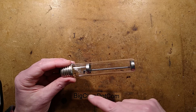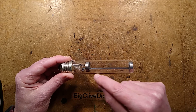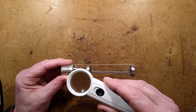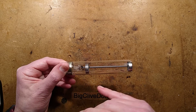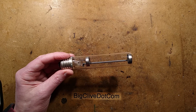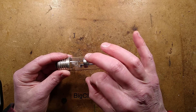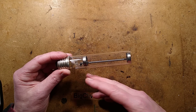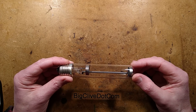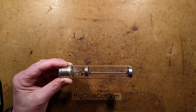That's more or less it. To summarize: ballast resistor, ignition resistor, ignition electrode, one electrode, the other electrode, neon as a carrier gas, and mercury vapor. I don't see any droplets of mercury vapor — let me just double check. I can see a slight hint of mercury vapor, a slight crystalline effect on the resistor lead but nowhere else. It's probably just enough mercury vapor needed to do the job. I was expecting it to have an amalgam in here that with heat would gradually liberate more mercury, but by the very nature of its operation it needs the mercury to be basically diffused through it anyway. That is the Philips TUV UVC lamp — and if you experienced any symptoms from viewing this lamp, let me know in the comments down below. It will be interesting for research purposes.